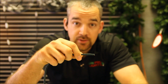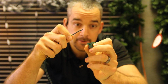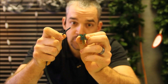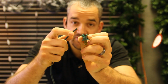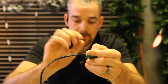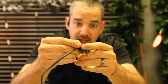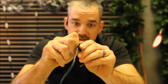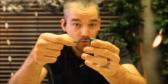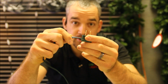So all you have to do is line it up with the little vampire teeth that's on the plug. This is the wide blade, and that's the vampire tooth. I will put the rib side on the right side. So I'll just slide this right here. Here's my wedge, and that just slides right on the back side, and I'll slide that in. So now I've attached my plug without any splicing. There's no wire nuts, no electrical tape, and this right here is a nice and secure plug.